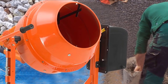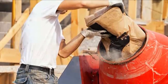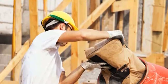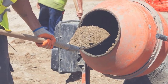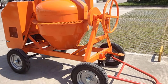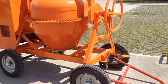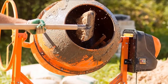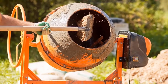The safety lock ensures no surprises, and the barrel can be tilted with ease to whatever angle the user prefers. Something that's often overlooked by folks shopping for portable cement mixers is frame strength. Motor size and drum capacity seem to be all that matters to shoppers, but the frame supports everything, and if it's not strong enough to handle the load, you're asking for trouble. Sometimes the biggest load isn't the drum tumbling with water and cement in it, but the sudden smash of an 80-pound sack of concrete on the lip of the drum, followed by slashing open the bag and dumping the contents in. If the drum isn't rigid enough, it can sustain a bent opening or a damaged axle.